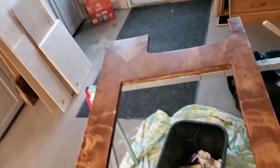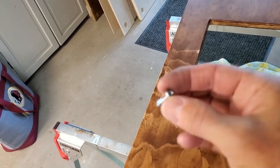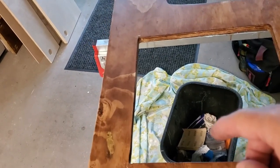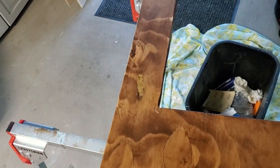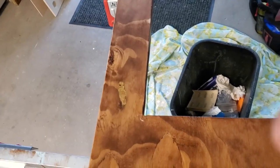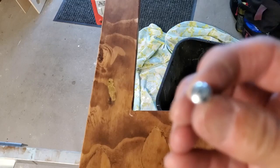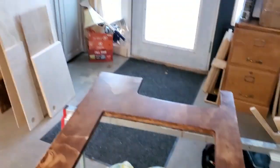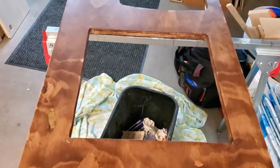So here's what I'm going to do: I'm going to take six stainless steel screws and drill through the top of the sink and just screw it to the wood with plenty of silicone caulking underneath. I'm not worried about it — this is not a high-end home or apartment, so I'm not really concerned.